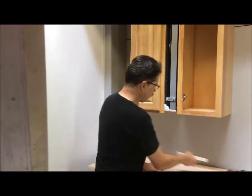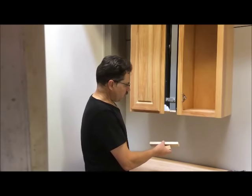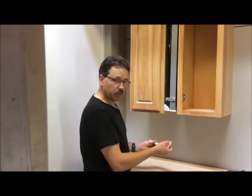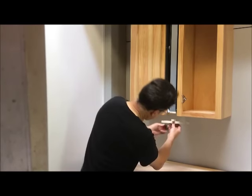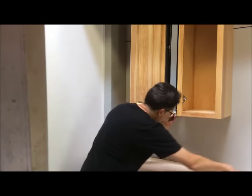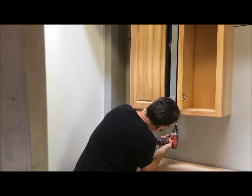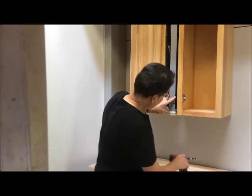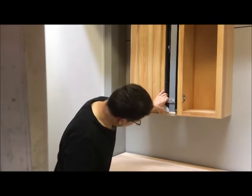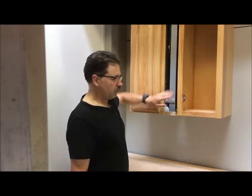And carefully allow the unit to move back up into the slot. Now we're going to put our cross block across the bottom to hold it to where it stops at its finished position. What we need to do first is, I'm going to have a half-inch bottom, so I made a piece of scrap material from the same half-inch material that I'm going to be using, and I'm going to put that on here. So first of all, I'll just get the screw started. Now when that comes up, that'll stop right where we want the bottom to hit across the finished unit. That sets us up with where our screw holes are going to be for the door.